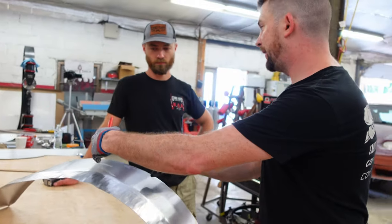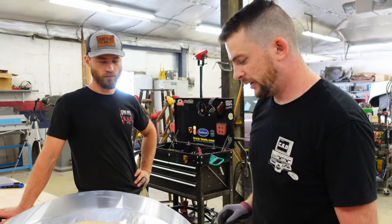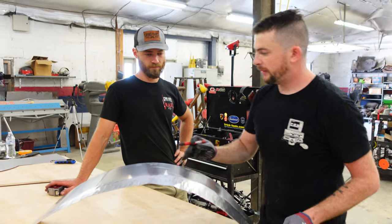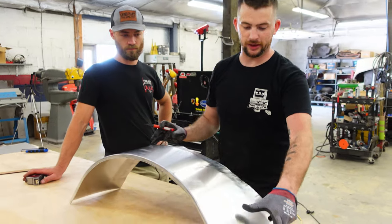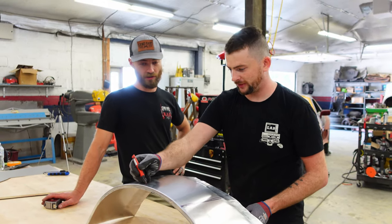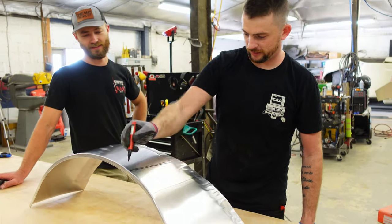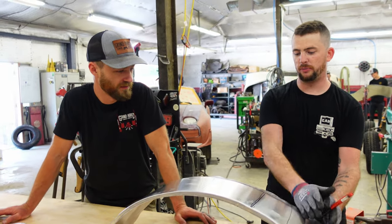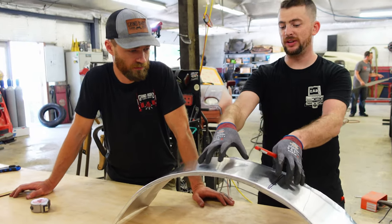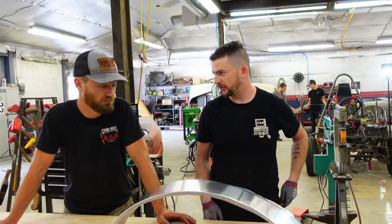I'm gonna overlap passes so that kind of blends the wheel markings, so there's only that much contact passing such a big wheel. Not only width-wise, but also length-wise. Basically I can break this up into four quadrants. Literally quadrants, four of them. We're gonna ignore that line here. You would want a wheel between one and two, then from two to three, and then from three to four, which means these two will get the most wheeling, so you might have to do a little extra to blend, but it blends your passes so you see them less.